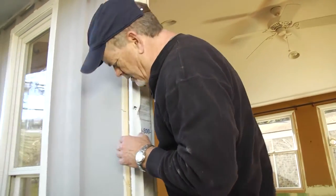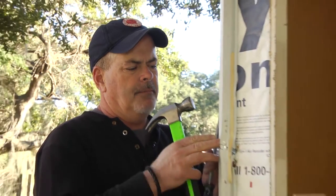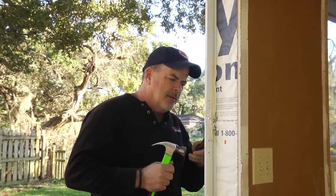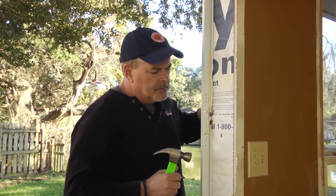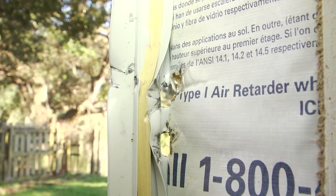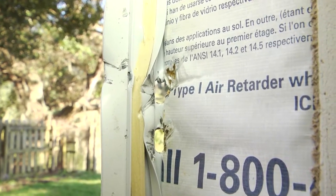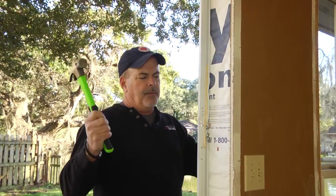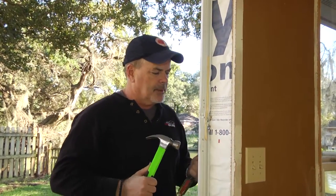I think I have an idea. Okay, so the frame, the flange goes behind the plywood. I don't want to cut into the house and go through all that. I'm gonna take a skill saw with a steel blade. I'm gonna cut the frame off, just bend around the remaining amount, and then frame it back in quick. Otherwise, I'm cutting back here, I'm framing more than I wanted to, it's just not gonna work for me. So,